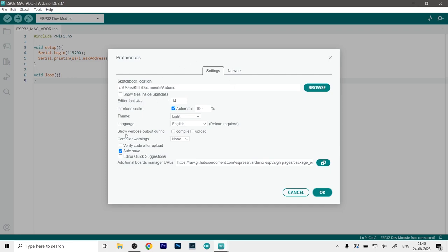This will open up this small window, and at the bottom here you can see we have the additional boards manager URLs. So here you have to paste the additional URL for the ESP32. As you can see, I have already pasted it here, that's why it is showing already. I will give this in the description box below so that you can also do that. And once that is done, you can just go ahead and click on OK.